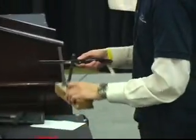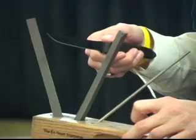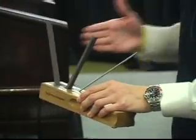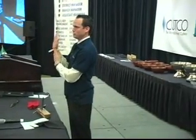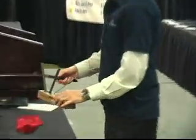You also want to make sure that when you're sharpening, you keep it perpendicular to the wood. If you have it tilted to the side a little bit, you can scratch your customer's knives. I remember I had to rebuy a customer's Super Shears because I didn't know what I was doing when I first sharpened some knives. I was just rubbing it on the stone, and it came back looking like a matte finish. It looked like the pizza cutter was scratched everywhere. So, my bad.